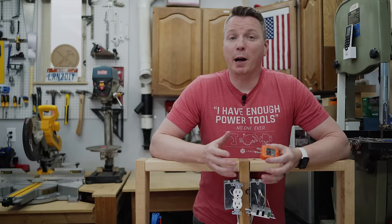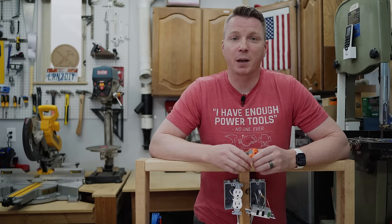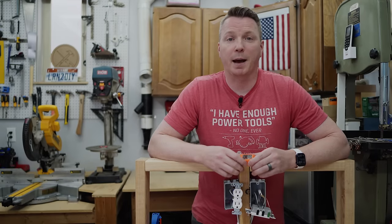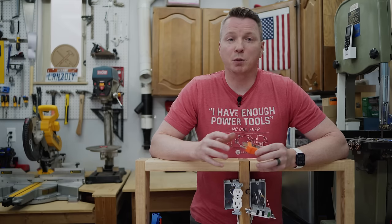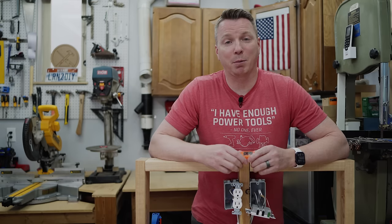There are a few telltale signs to help you know if it's worth looking for a bootleg ground in your house. This is most common in homes built when ground wires weren't as common — the 1940s, 50s, 60s, or 70s are the most common decades. Also, if you've got some two-prong outlets in certain parts of your home but not others, that's a good indicator the house was built without a ground circuit and that maybe some upgrades were made — and maybe they were done properly and maybe they weren't.